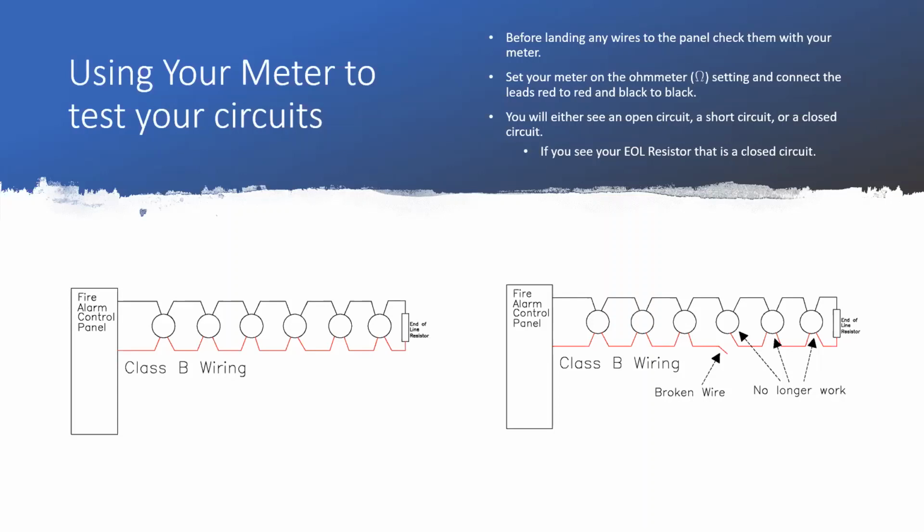The other reason, even though it's an extra step, it'll actually save you time in the long run to do it this way. If you don't check these things and you hook it up at the last minute and you're crossing your fingers and hoping, saying no ground faults, no shorts, you're really hoping for it the day that it's time to turn on the panel, then you're waiting till the last minute, and any trouble you get is going to start delaying your job and slowing you down.